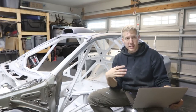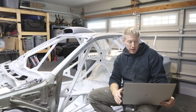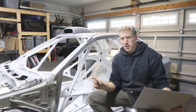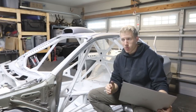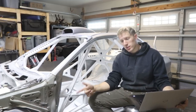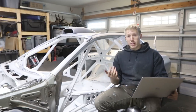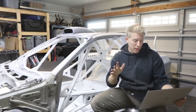Next was the actual blade for my chop saw. I went with an Evolution saw blade and that was $78.75. It's kind of expensive initially, but it can be resharpened and reused for a long time. It doesn't wear out unless you use it improperly — make sure your material doesn't spin and your blades will last a lot longer.